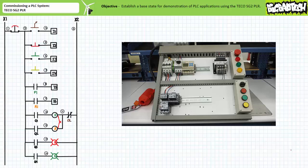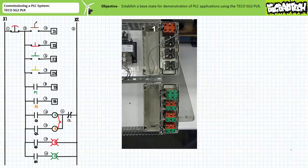Let's begin by routing wire 1 from the control transformer output to the normally closed e-stop. Wire 3 then goes from the e-stop to the first four field input devices in the bottom push button enclosure.